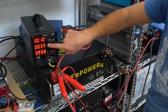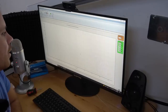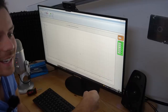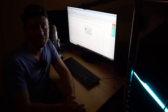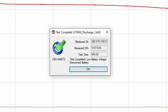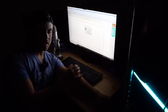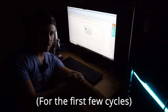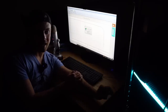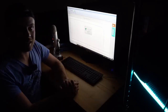A few hours later and we hit high voltage disconnect, so this battery is fully charged. Now connected to the CBA4 and amplifier system, the test has started. Sadly, this test took 10 hours — we did a 0.1C rate because we can only pull 19 amps at a time. The results: we pulled 200.9 amp hours and 5,187 watt hours. Something I've noticed with server rack batteries is they pull exactly how much they're rated for — less than half of 1% over rated capacity. So it did exceed the rating, but just by a tiny amount.